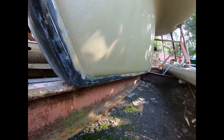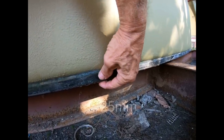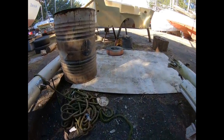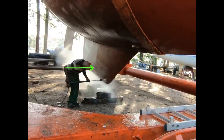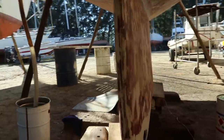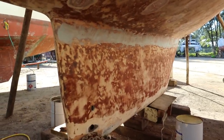That gives me an idea — I'd love to do the same thing, but I'm probably going to go ahead and put more layers of fiberglass on the bottom of my keel instead. It's about an inch thick, rounded on the edge. Now let's look at the keel on our Valiant 40. You can see a definite vertical line — forward of that line it is solid lead. Behind that it is just a fairing: closed cell foam encapsulated in about three-eighths inch thick fiberglass.